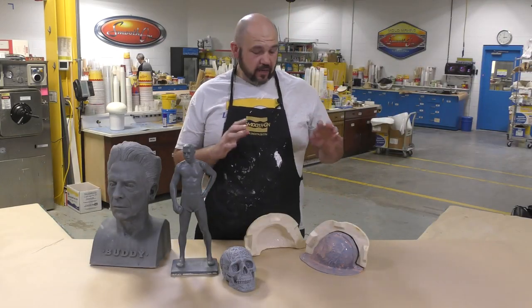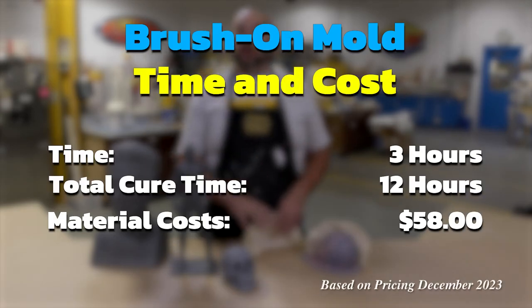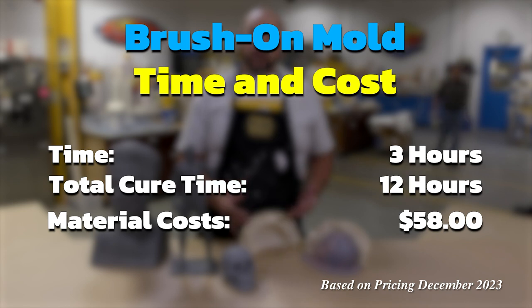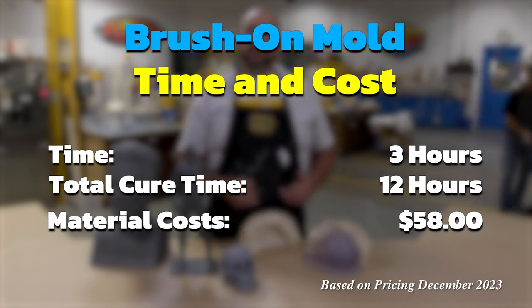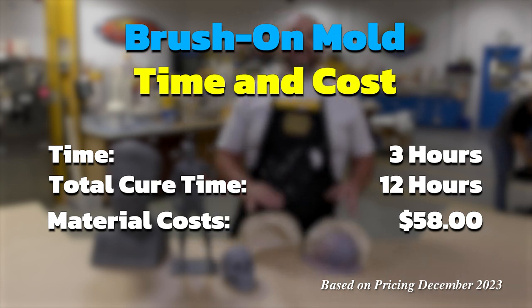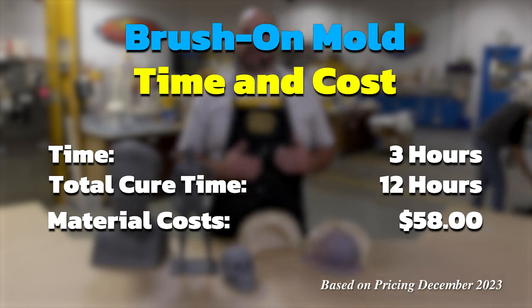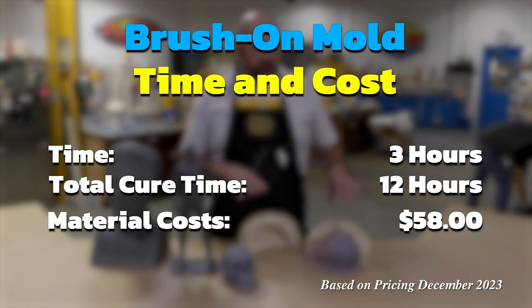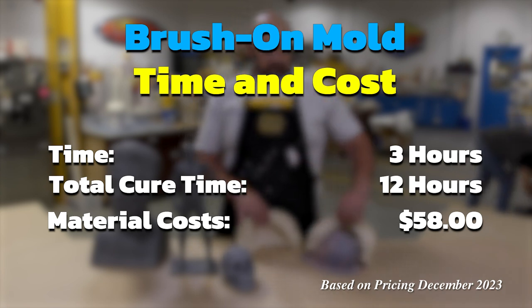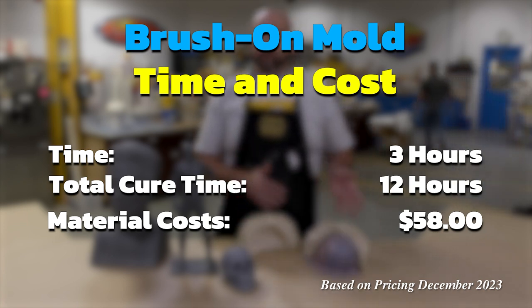All right, let's take a look at our brush-on mold that we created here. Now, the total working time we spent on this mold was 3 hours. That's with the brush-on and making of the support shell. There was an additional 12 hours that was spent in between the layers and waiting for the material to cure. So total time invested in making this mold is 15 hours. The material cost for this mold is a lot less than the material cost for a block mold. It cost us $58 using 2 different materials to create this brush-on mold. A lot less material was used.